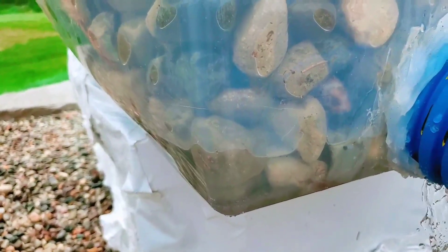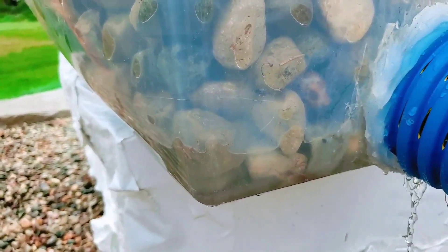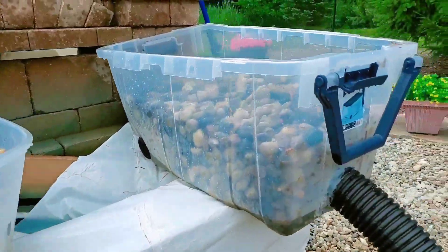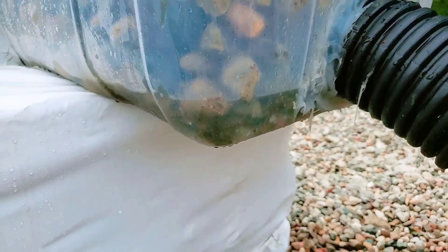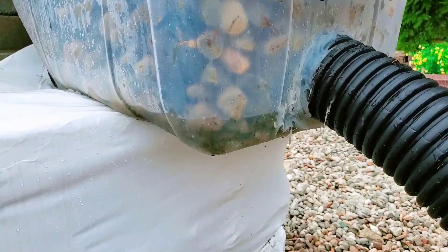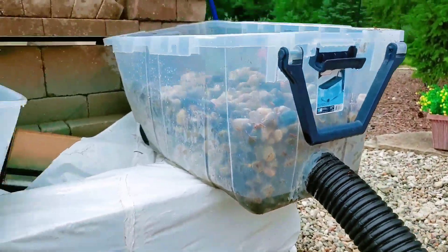It drains all the way to the bottom of the bin. When you lay the pipe right at the bottom of the trench — like with the peanut pipe — look at all the water you leave behind. Those trees will sniff out that water and the roots will fill your system and ruin your system.